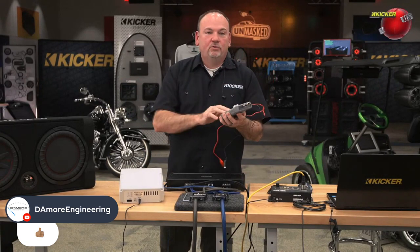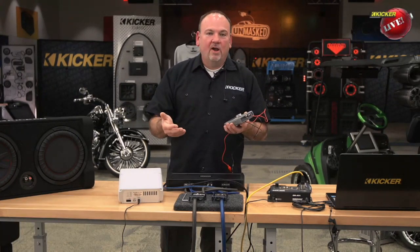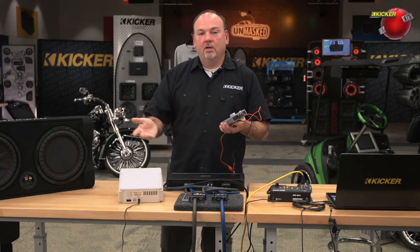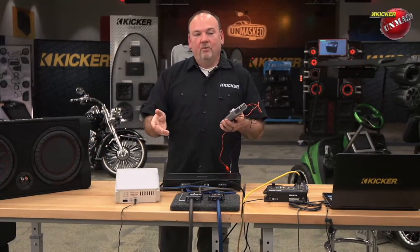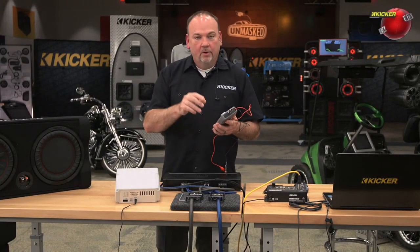And hopefully you can see — if you don't have a tool like this, you can always get test tones. You can throw those on a USB thumb drive. You can get apps on your phone to get all the different frequencies that are available. And you can see what the tuning is on a ported box or a passive radiator box simply by starting — don't play it too loud. You don't want to smoke your woofer. A constant sine wave at high output is really bad on a subwoofer.